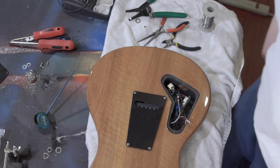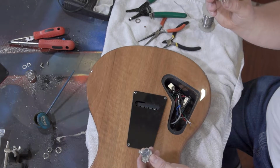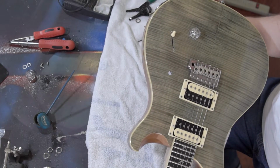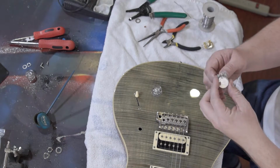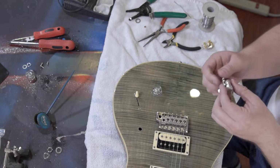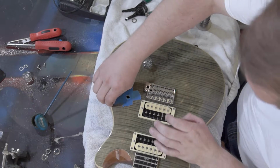In other news, the new shaft is slightly bigger than the old one, so I am going to have to wallow out or drill out the hole in the guitar body just a little bit to accommodate. To order these pots from PRS, they're only like $5 a piece, but they have a $20 minimum plus shipping plus all sorts of stupid, so not doing that. Okay, so after some very gentle drilling,